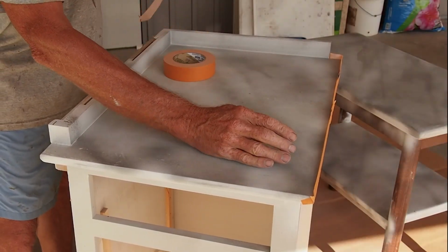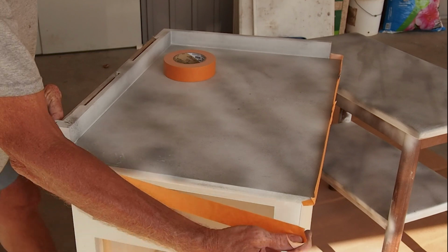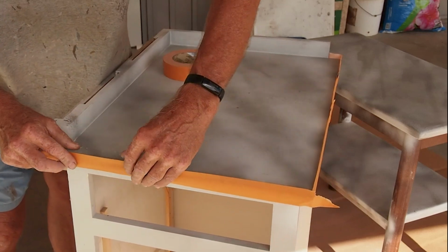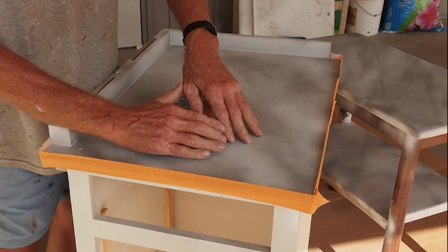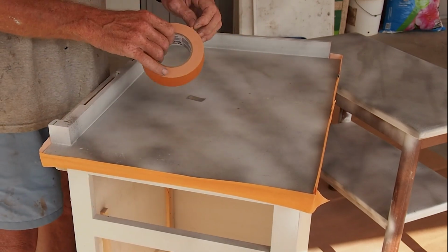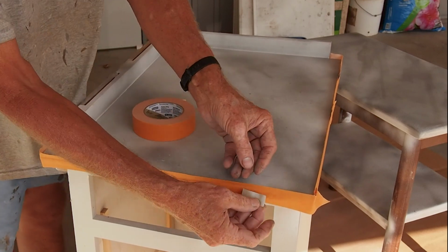Because the epoxy is liquid when you pour it, it has to be contained on your level surface, and regular masking tape works great for that. You just take a piece and attach it on the edge of the piece that you're pouring the epoxy on, seal it around the edge, have it stick up. When you have a long piece of masking tape and you pour the epoxy on it, it wants to kind of push over and flow off the top of the masking tape. So what I found is just a little piece of sheet metal I can cut. Tape on the side creates enough resistance to hold that in place.